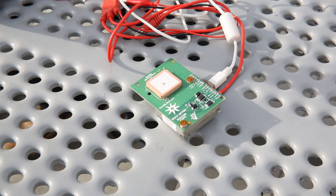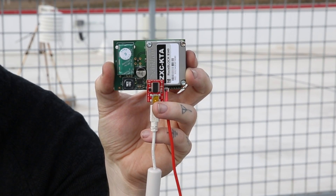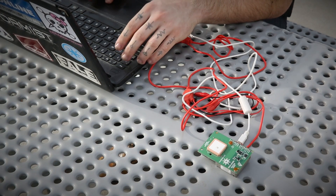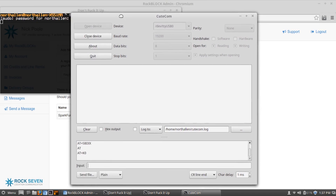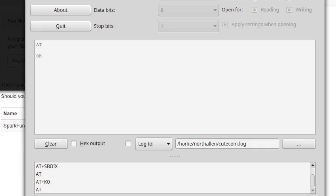Using the ROC Block is actually pretty easy. You just connect it to 5 volts, then connect a 3 volt FTDI or other serial connection, and you can talk to it over UART. It runs at 19200 baud, so if you connect it using an FTDI, you can just open up your favorite terminal program, type AT, and you'll see it responds with OK. That means the module's awake and it's paying attention to the commands you send to it.